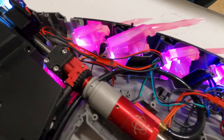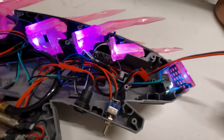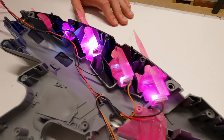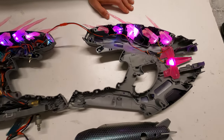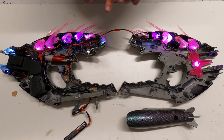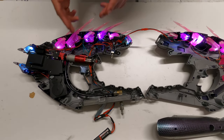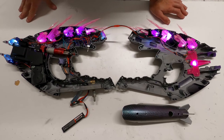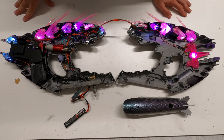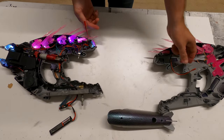Wiring for the FCU to power the Polar Star is actually pretty darn simple. And as we can see, there's a wire extending over here to the other half of the Needler, and this all connects to the rest of the LEDs on the other side. It makes it really easy to disassemble the gun and work on it, because the way the gun is originally wired up, the front needles are wired across, the second set of needles are wired across, and so on — creating this webbing of wires that goes between the two halves and it's really short. So in order to split the gun apart for maintenance and troubleshooting, it made a lot more sense to just rewire everything to this one split connector, and then that half of the gun can go away.